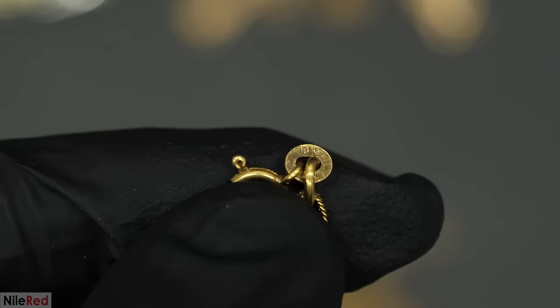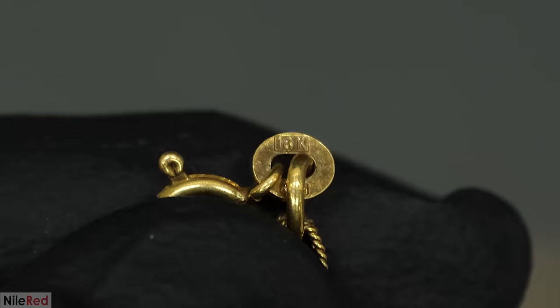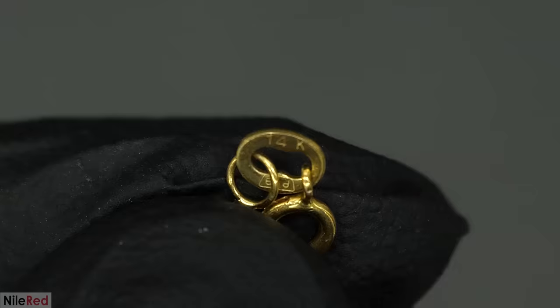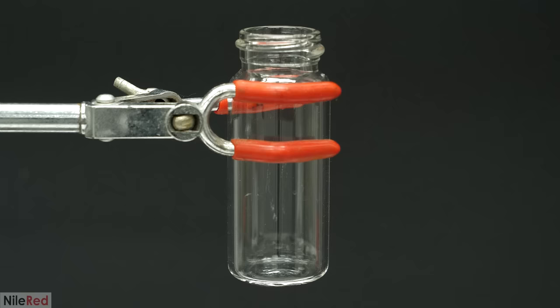The first thing I wanted to know was the purity of gold in each of them, and to do this I just looked for a stamp. I was able to find one on three of them, where two of them were marked as 18 karat, and the other one was marked as 14. One of the smaller ones wasn't marked, though, and the clasp of this one had broken off, where it was probably written. So now, because I didn't have a real idea of what these chains were made of, I had to test them. There are a lot of different ways that this test can be done, but I just used what I had on hand, which was concentrated nitric acid.